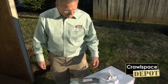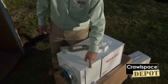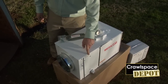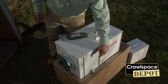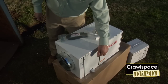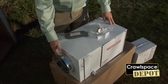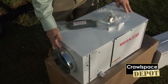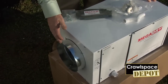The MegaDry dehumidifier, specially designed for use in crawl spaces, especially closed crawl spaces. It has a port on both sides, so you have filter replacement capabilities accessible from either side. It also has the ability to hook the condensation line up on either side, and comes with already collared 8-inch duct line attachments so that if you need to run the air or the return from tighter areas of the crawl space, you are ready to go.